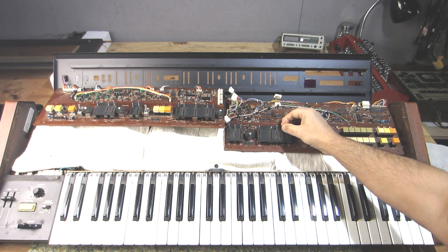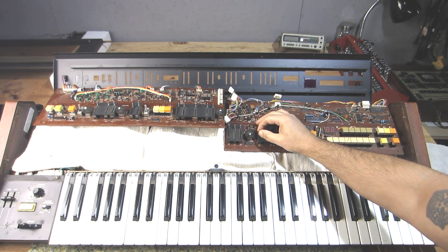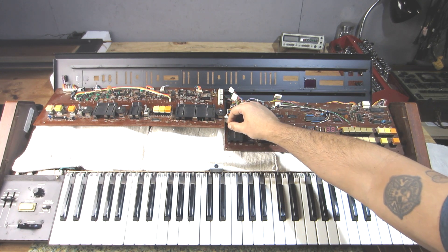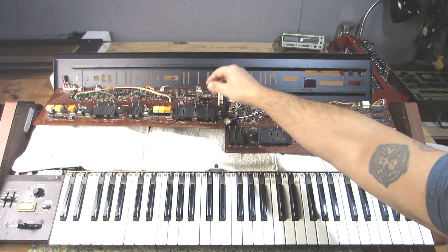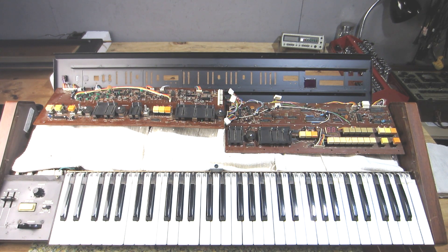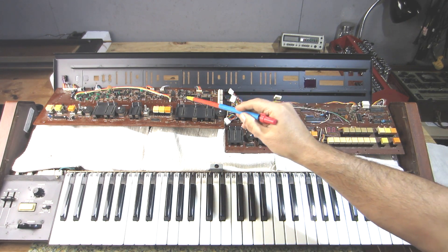Some of these are moving okay, but some have a stiff spot and feel grubby and rough even after multiple flushes. This one right here is still pretty nasty — this one is a bit stiff, and this one is hitting a little obstacle. I don't want to mess around with it. They're not all responding favorably to flush-style cleaning. They've been flushed out probably three times. There comes a point where you have to tap out and make a choice — dive deeper or source some replacements.